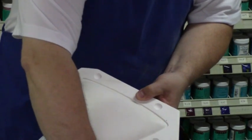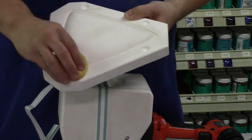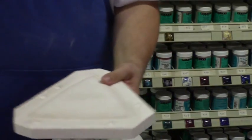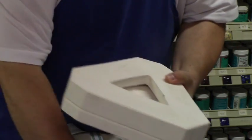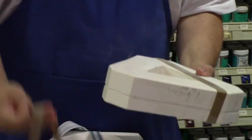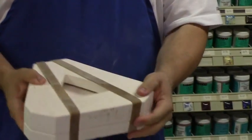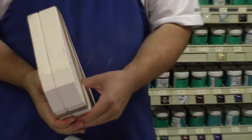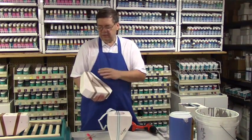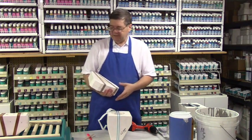Likewise with the bottom half of this mold. Let me show you how the rubber bands work — these are just stretched on. Several people have asked how many rubber bands to use. Well, you need to put enough on so that the mold is secured tight and it won't leak. If you don't have a sufficient number of bands or a good strong locking strap, you run the risk of the mold leaking during casting and then you have a mess, not to mention wasted time because you have to cast the greenware all over again.